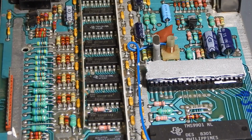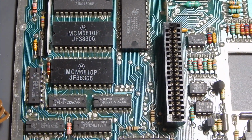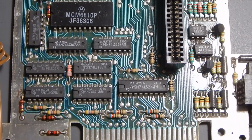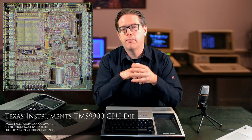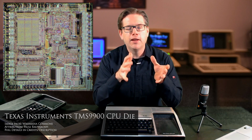And yes, of course, the development of 16-bit peripheral chips and faster RAM could certainly alleviate some of those bottlenecks. Well, the TMS 9900 had some other architectural shortfalls that most likely removed it as a candidate for IBM's PC. Now, one of those was a 16-bit addressable memory space, which basically meant the TMS 9900 could only leverage a maximum of 64K of memory.